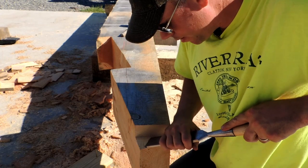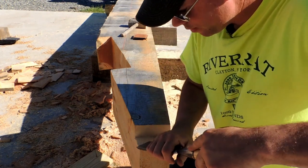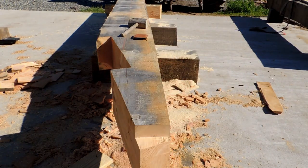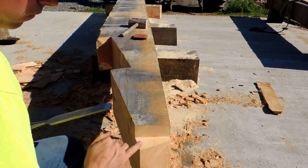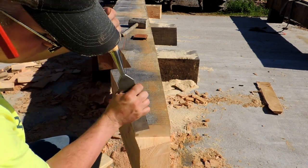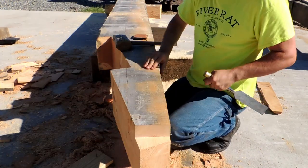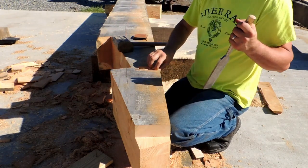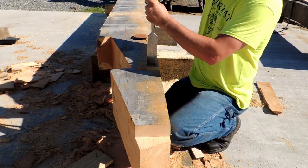There are some things you want to be very fussy on when doing this stuff, and other things you can get away with. This is one of them, at least in my experience — it cleans up real quick and easy, especially when you kerf out real fine. I don't pound the chisel real hard when knocking these out — just real light with it. You don't want to break your chisel.